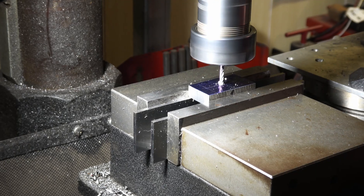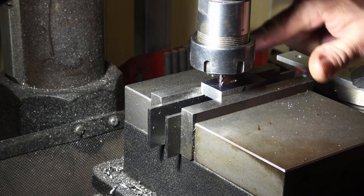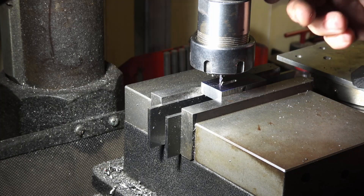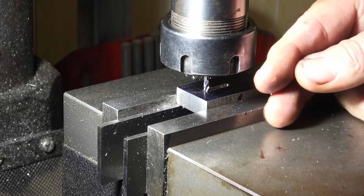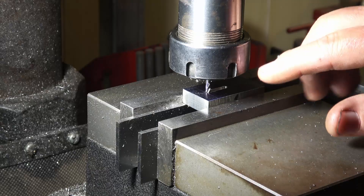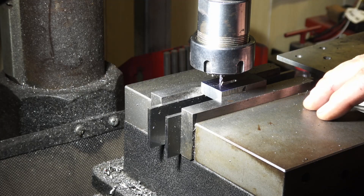The slot is all the way through and now I need to cut each side to fit the tang. One other reason I like to flip this guard: if I mill with the 1/8 bit from the back side through to the front, I have to get very deep and risk flexing the end mill, since I'm right out on the end cutting that final slot. If I flip it over I'm cutting more along the middle of the end mill — I get a better square cut, don't have that flex, can see it, and don't risk breaking an end mill.